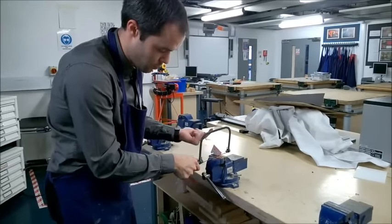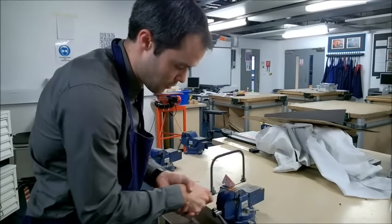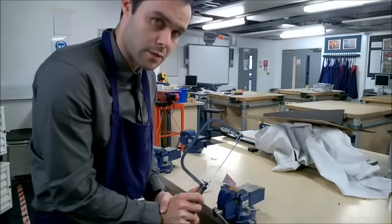When we want to remove the blade, some people just pull it out, but the blade will snap because it's trying to get out of the curve. We want to keep the blade moving and follow the path back out — a bit like navigating a maze — until the saw comes out.